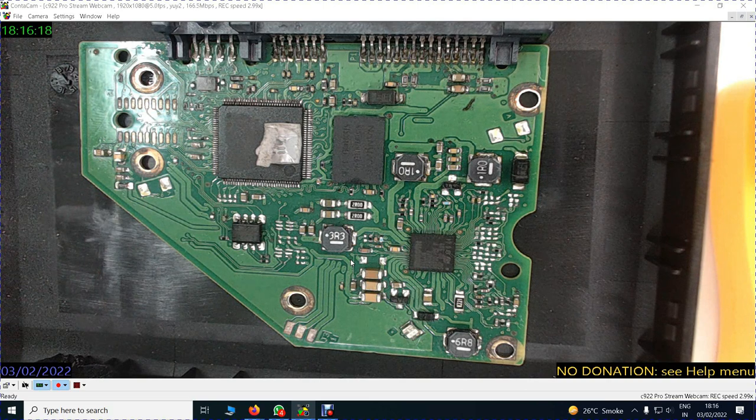If a PCB has black colored rivets, normally they are all gold colored in the beginning, that means erosion has taken place. The upper layer of the rivet could have eroded and it is not connecting from the wire of the rivet to the second area. So faults may arise below this layer in the wiring.